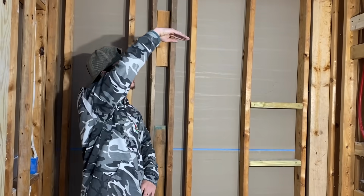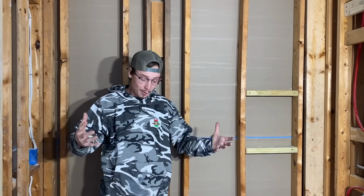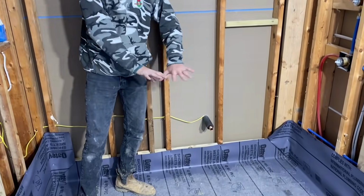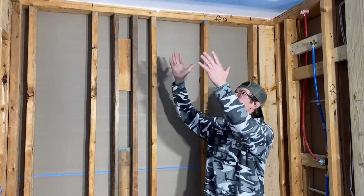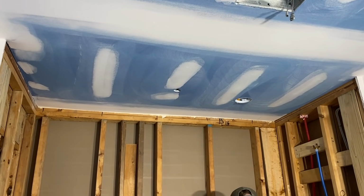Or right? You can make it flow off one way or something like that. I mean, heck, we're definitely going to do our research before we just start slapping stuff on. But before we start doing our mortar bedding here, we gotta have our cement boards on the walls. That way we do it towards the cement board. But before we even throw our cement boards on the walls, we gotta go ahead and rip out a piece of sheetrock, dude. That is right, dude.